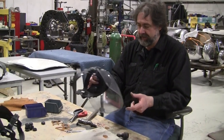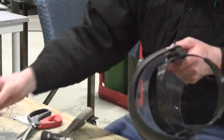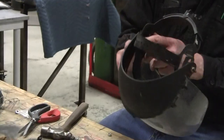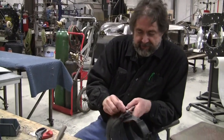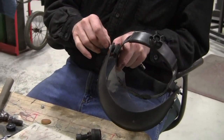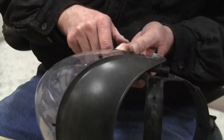So this is their safety mask — very well built, except for the little plastic nuts that keep it from rotating. It becomes annoying that it doesn't stay up. I tried a standard quarter-twenty nut, but found out that's not quarter-twenty — that's a metric thread, it's a 6mm by 1 metric thread.